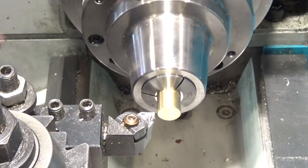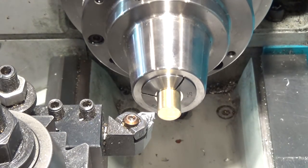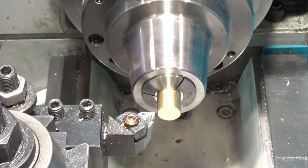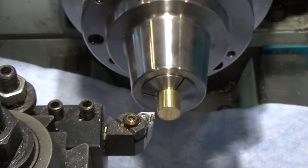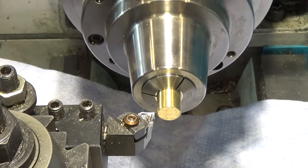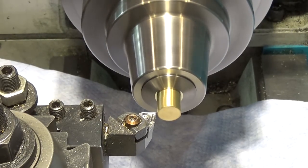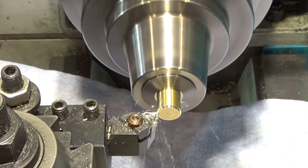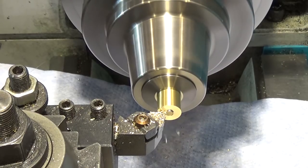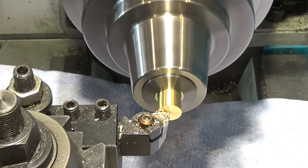What I've done is touched the face just to find the rough depth, gone over 25 thousandths. So we're just going to face these off. I'll do all 12 or 13, then flip the part over and do the same thing on the other side. This is brass, so because it's such a mess and it just seems to stick everywhere, I tend to throw some magnets down and then a piece of cloth just to capture most of the chips. I've locked my carriage, so I'm going to take each part, put it in all the way until I hit the depth stop, face it off, pull it out, and move on to the next one. I won't even have to re-measure or anything.